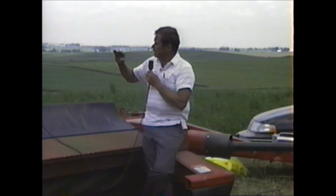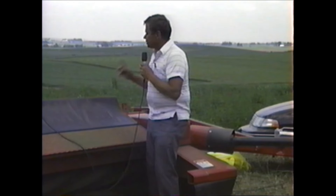The other issue is the down-crop condition. If the crop is lying down and you're going in the same direction, the knife is only going to cut as high as the path it makes above the ground — probably an inch and a half to two inches right now. If the crop is laying down more than that, it's not going to cut it off. There's nothing to pick the crop up the way a reel does. So you have to weigh the good with the bad when considering this machine.